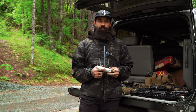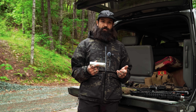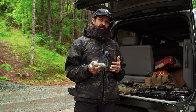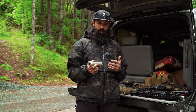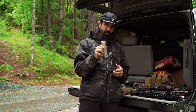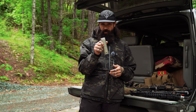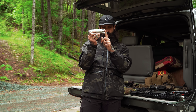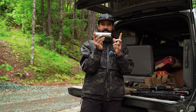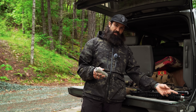The goal we set out for was to make a gas gun suppressor for duty use. I really wanted low back pressure with good visual and audible reduction. That means we've got a can that is less than six inches overall length — final variant clocks in at 5.72 inches from the base to the end cap.